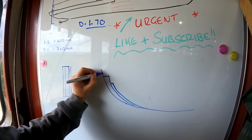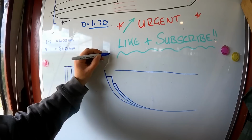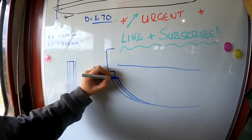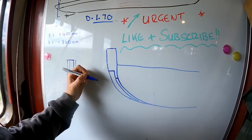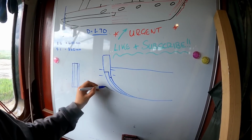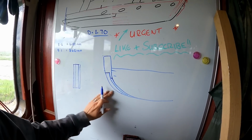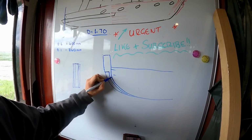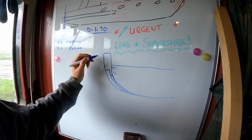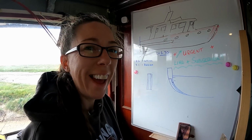So we did want to extend, there's the deck level, we wanted to extend the stem. So now all we have to do is go back to the workshop, and what we'll do is we'll cut a piece of wood like that to attach it in, and then we can bolt it through. Obviously we've still got the outer stem to do, but not yet, so we won't worry about that. So we've cut up to there now. We'll extend it up because we wanted to for the bulwarks, and we only have to replace the very top bit. Woo! Yay!